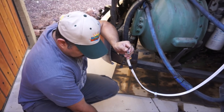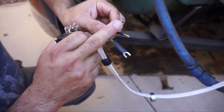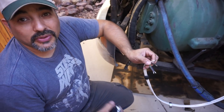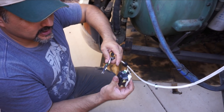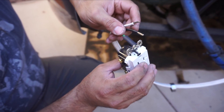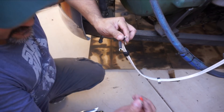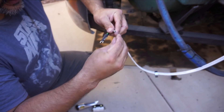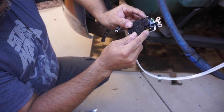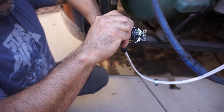We've been using spade connectors because this is marine grade cable, and as you can see it isn't solid like most house wiring. The standard pinch connections just aren't good enough for stranded wire, so we've had to add spade connectors. We've also been using ferrules — again, just to keep the wires from splaying out when we insert them into the connections so they fit right in cleanly.